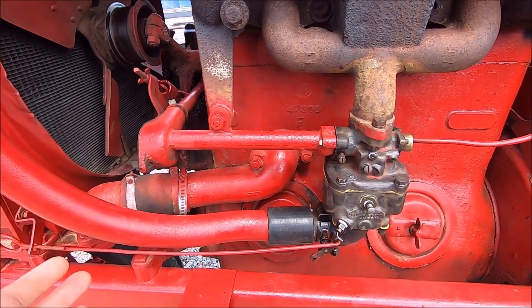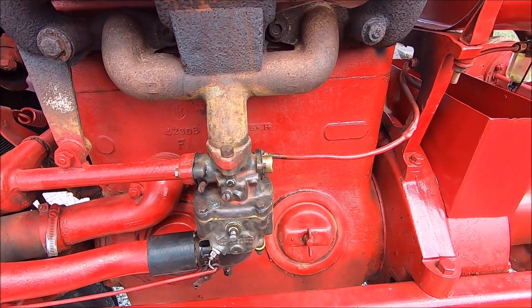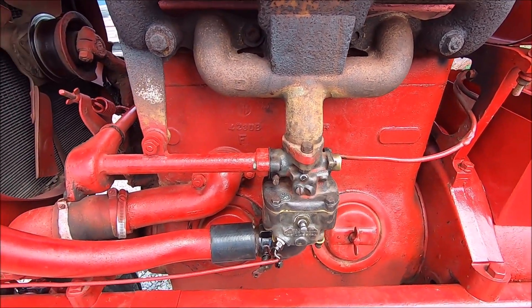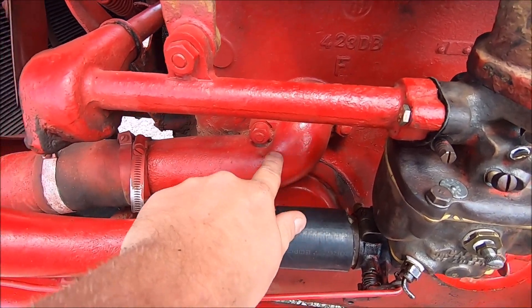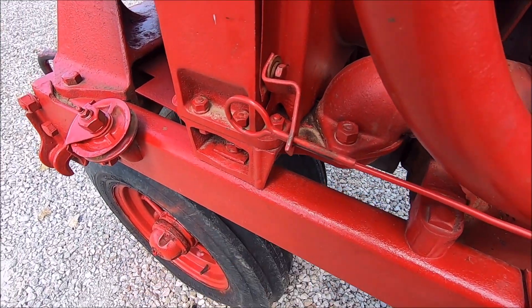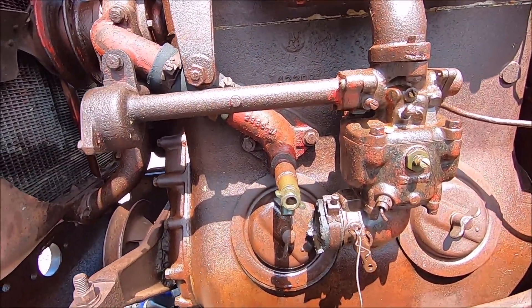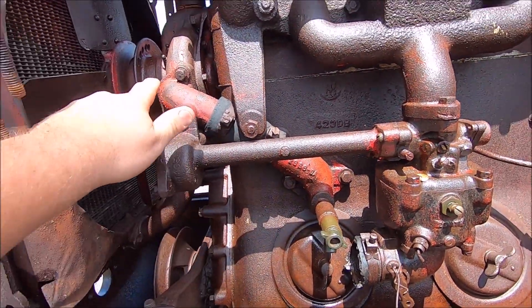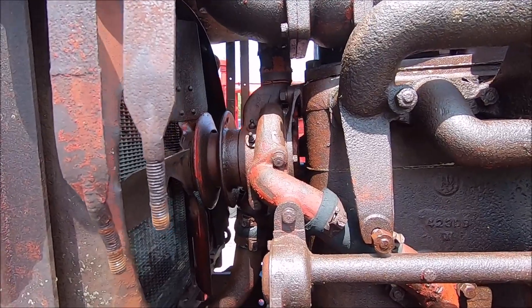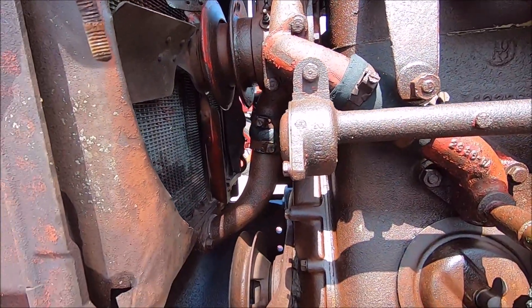Same basic block design, though there are a couple of differences. The F20 has a pad here with the serial number and stuff on it that is not present on the T20. You start to see the first difference with this water pipe here that runs to the bottom radiator on the left-hand side. On the crawler, however, instead of this pipe coming down to that part of the radiator, it goes up into the water pump.